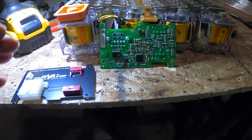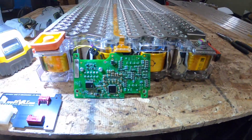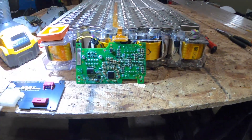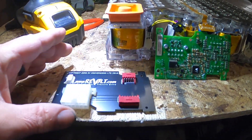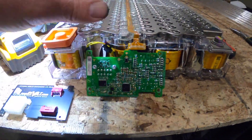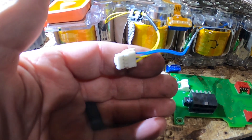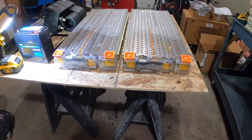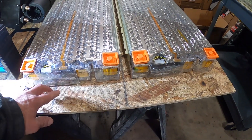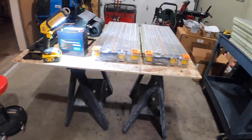One of the last steps in getting the batteries ready for the battery packs is to replace the BMS board. The BMS is a battery management system — it's going to monitor all the voltage of the cells. You don't ever want to go over 4.2 volts per cell. This is a proprietary board that ties into the Tesla computer, and it's been replaced with an aftermarket board that basically just gives you a wiring connection into the ribbon cables, which connects to all the cells and also the connector for the two thermistors for monitoring the battery pack temperature. The board conversion for the BMS has been done on all six of the batteries. Special thanks to EV Racing, who supplied the batteries, and the boards came from Amp Revolt and Zero EV. I'll put links in the description for all the suppliers.